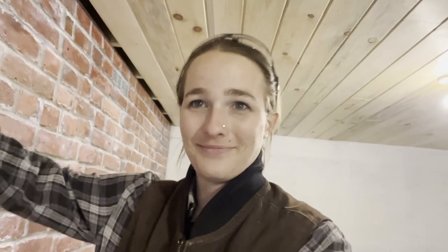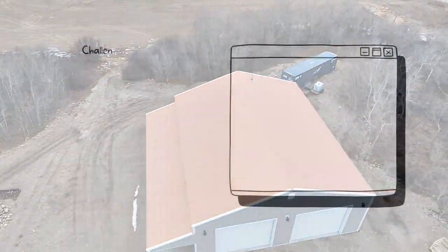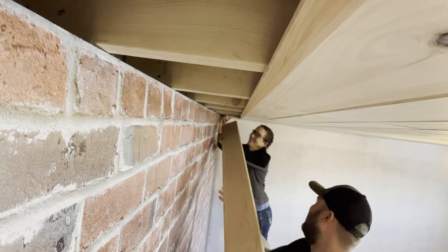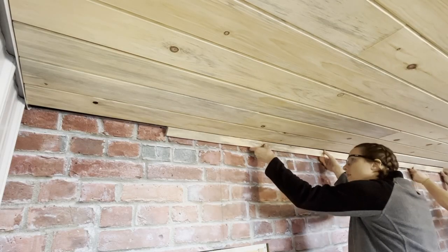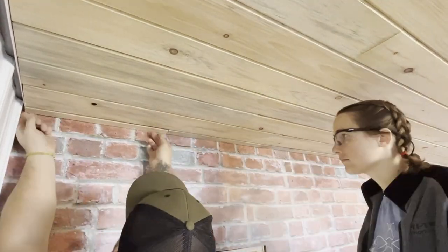We've got one final piece that needs to be done. Unfortunately, the middle of the wall is bowed, so we're calling it a night and going to think about it — maybe a trim piece. This final piece of pine had to be about an inch and a half on each corner, and then it bowed to about two inches in the middle of the wall, so we had about a half inch gap to account for. We pulled down this board and cut the width to size using the table saw. We did have to adjust from one side of the room to the next on the width, but here we are on the home stretch, installing that final piece. Once the entire section was up, we nailed directly through the pine board to finish it off.